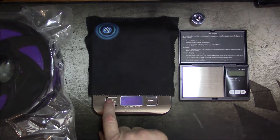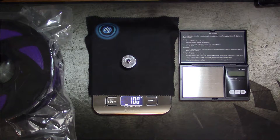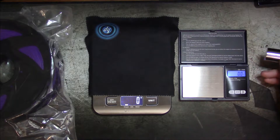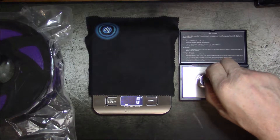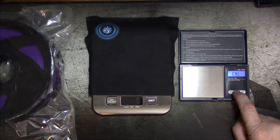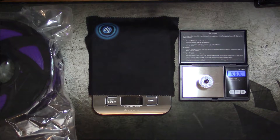Let's check them out. The kitchen scale reads zero; setting the hundred gram calibration weight on it — it says 100 grams exactly. Now the Hornady scale: it boots up reading grains, so I'll switch it to grams. Setting its hundred gram calibration weight on it says 100.01. Let's calibrate it — hold down mode until it says CAL, lift off, press once more, wait for it to request the calibration weight, set it on, wait for it to say pass. And it does. Setting it back on — it reads 100.00.